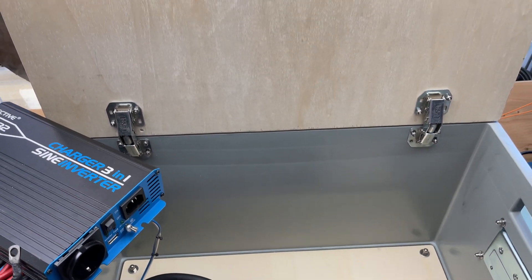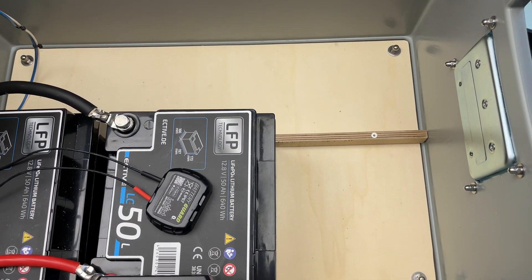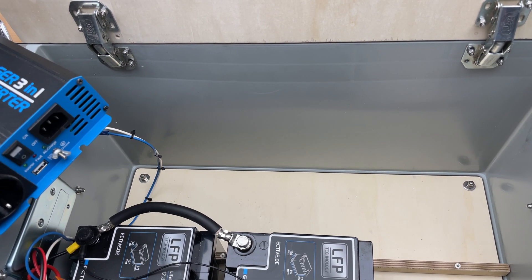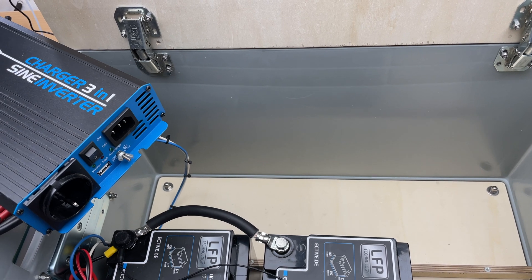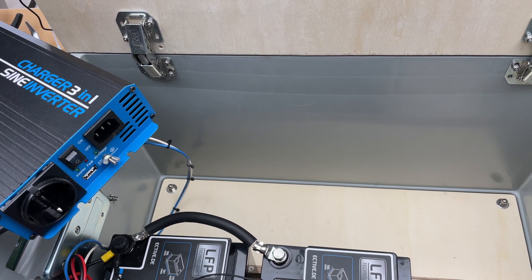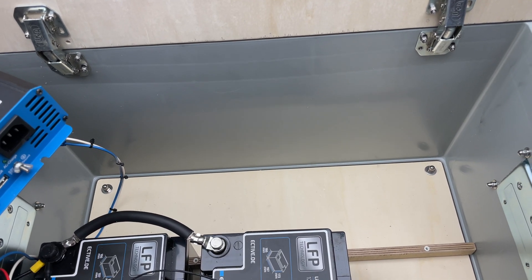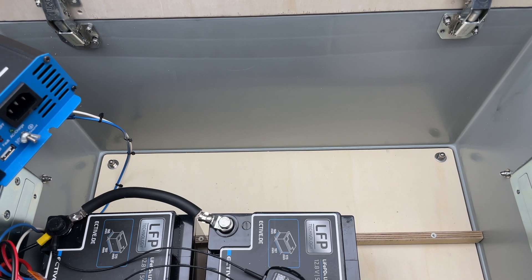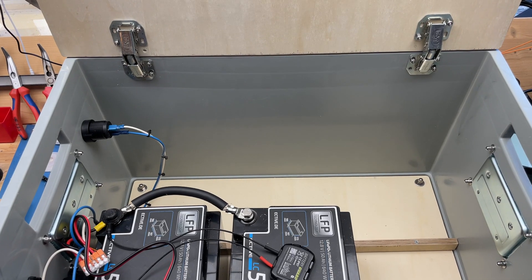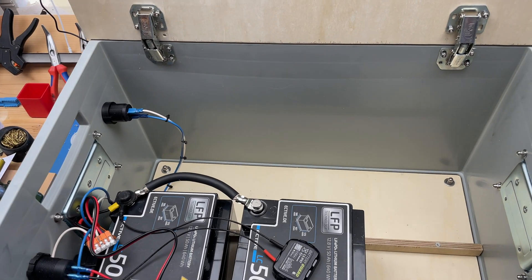I'll order a proper 230-volt charger — maybe mount it to the lid. I'm already running out of space since a third battery is supposed to go in here, plus the main inverter in the back. I could get a big combined inverter-charger, which is neat, but I prefer separate devices so that if one part fails, the rest keeps working and I can replace individual components. There's still a lot to do — let me know in the comments if you like this type of video and want to follow the build further. See you next time, thanks for watching.